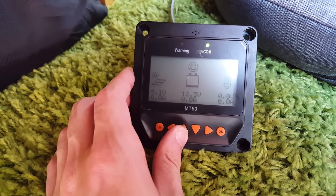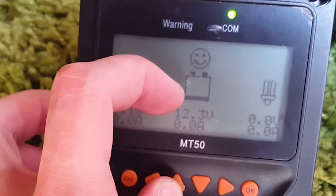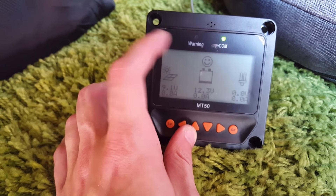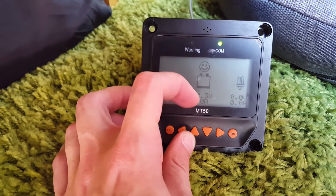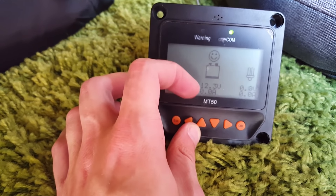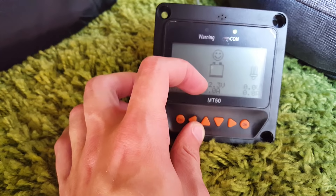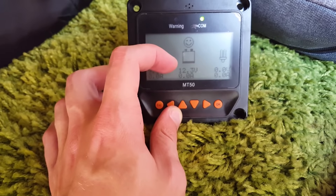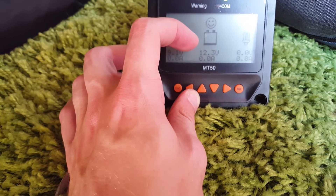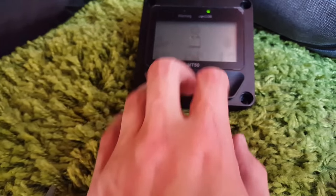That still doesn't solve the problem of why, even when I'm getting 14 to 17 volts coming in, it's not charging past about 12.3 or 12.4. I've hooked it up to shore power before and seen it get almost to the top at 14.7 volts charged, which is what it's supposed to cap out at — that's considered a full charge for these batteries. But this controller I think is a little wonky and has never done it naturally. The highest I've gotten naturally is 12.7, which is not high enough.